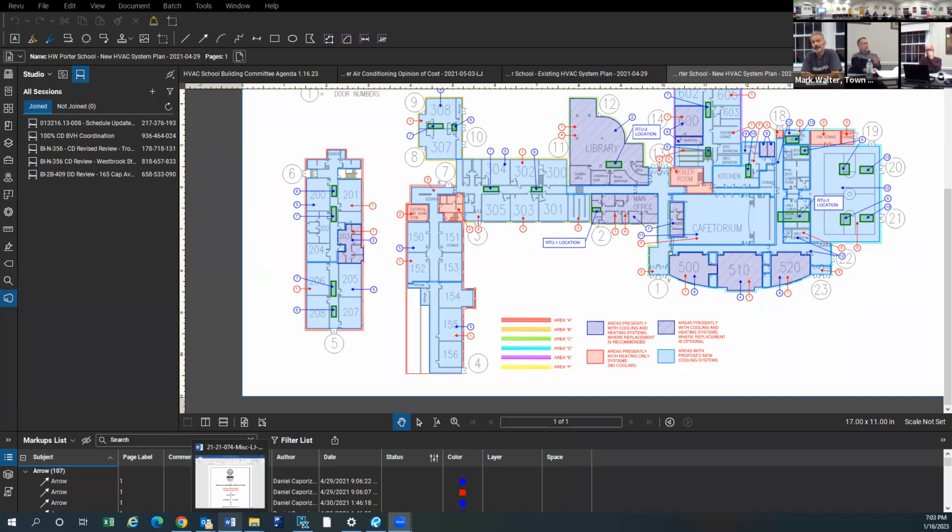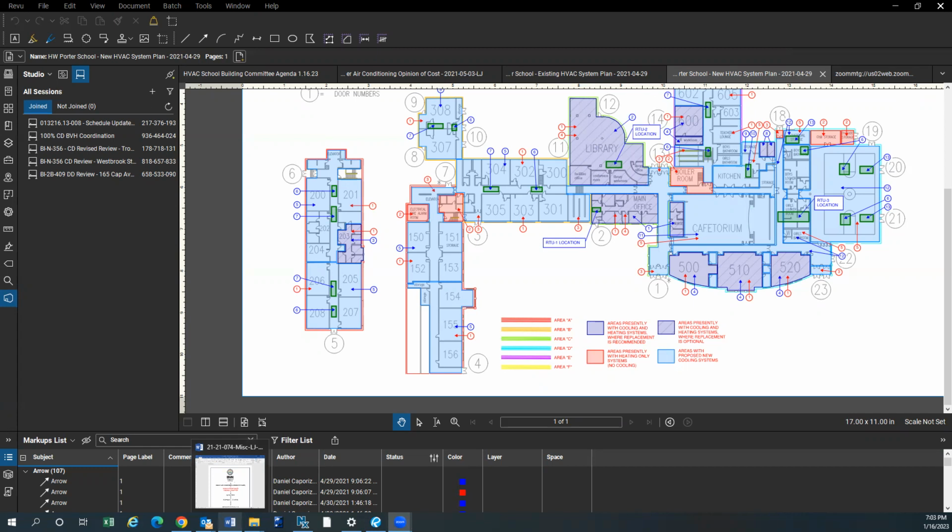Because the electrical, obviously, would be a separate bid, right? That would be a separate contractor typically. Well, I would think it probably would be, if we're going to do it in phases. Yeah, I think we have to break this into two specs, upgrade electrical. Well, it's going to be all part of that. Whoever's going to do the engineering would do all of that because they have to be able to supply power. Am I correct, Larry? You would probably be doing both the HVAC and the electrical. You need one engineering firm to do both so that they're coordinated, because otherwise you're not going to buy the right circuit breakers and things you need in the second piece.